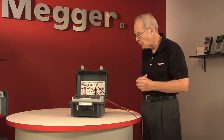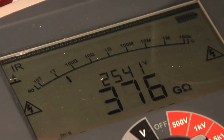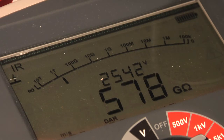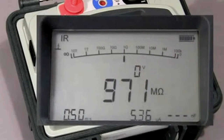Depending on its condition, it calculates a resistance reading and gives you additional information. The actual applied test voltage is displayed — the test item will always load up in voltage a little bit, so you'll get an actual test voltage slightly higher than your selected voltage. It also shows you the reciprocal of resistance, which is the leakage current, so you can look at the leakage current directly. Finally, there's a timer — insulation resistance tests are highly dependent upon time, and a convenient timer on the display keeps you apprised of that at all times.